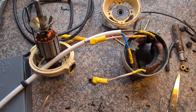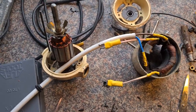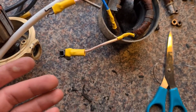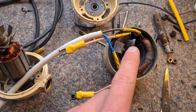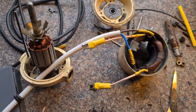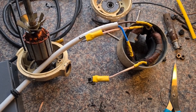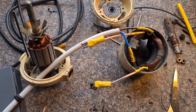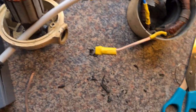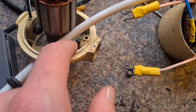Fast forward about an hour — I had to go down to a friendly car shop and get some heat shrink for about 30 pence. This is all cleaned up and rewired now. Removed all the knackered old heat shrink, got in there some fresh new wire, cleaned it all up with a bit of alcohol and a bit of emery paper on the motor brushes. The trick now is trying to fit all that back in the lid of that motor without knocking the wiring when it spins — I might have to employ a couple of little cable ties.